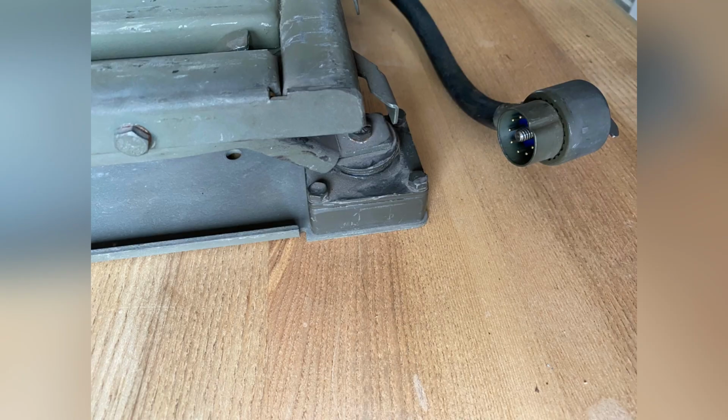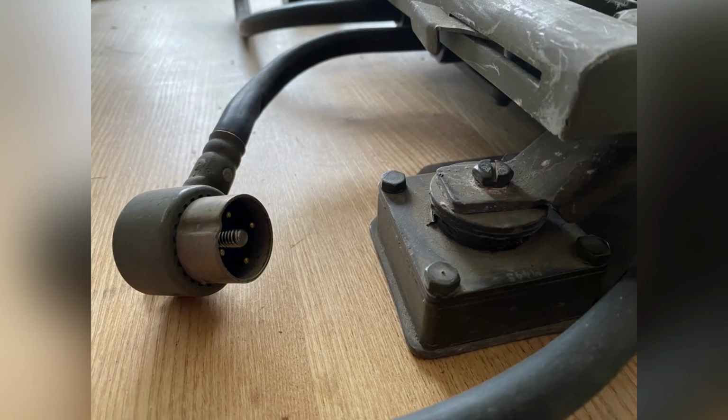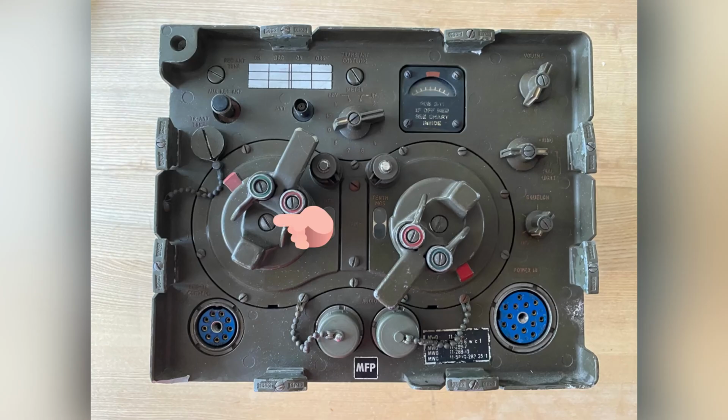In the double conversion receiver part, you find an RF stage, a first oscillator and first mixer to a band of 4450 to 5550 kilohertz. Going back to the RT-67 unit, for your information, the left big tuning knob at the front serves a crystal oscillator and a harmonics generator by switching to the desired megahertz. There are 12 crystals to choose.